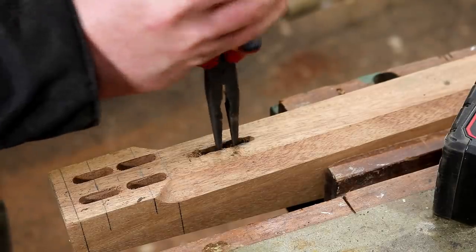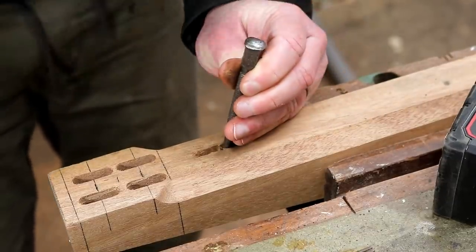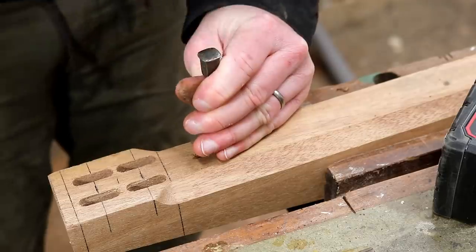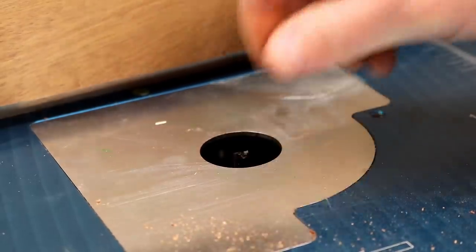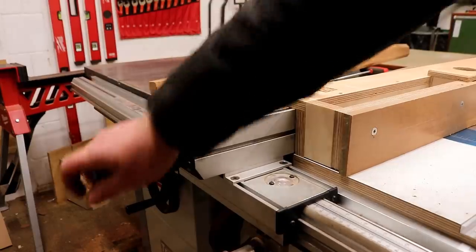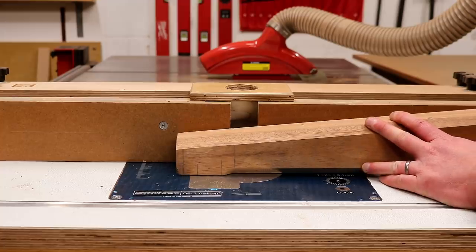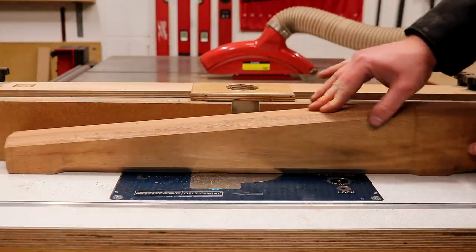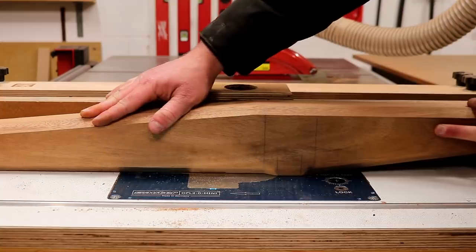Most of the damage is going to be hidden as it's right where the housing groove is going to be. Some of the screws I just couldn't get out, so instead I'm going to hit them down into the wood and I'll just need to make sure that my housing groove is less deep than where the metal is. After setting up a straight bit in the router table I can then route out the groove, making sure the workpiece is pushed firmly against the fence at all times, lifting the bit between each pass to take it easier on the machine until the groove is at the depth I need.